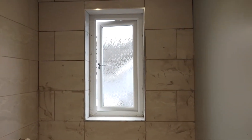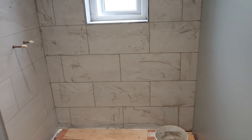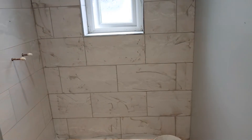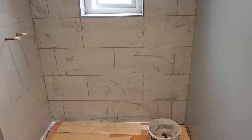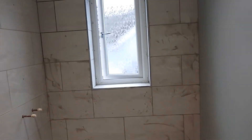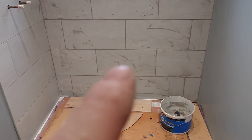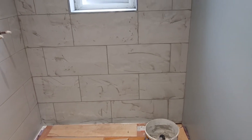You really want to get your walls as flat as possible. If you're getting a plasterer to set your walls out, get them to do it as flat so that there are no humps or bumps or shallow areas. Don't worry about it being smooth — you want it flat — because these big tiles have no movement, you can't flex them, so as flat as possible makes tiling a lot easier. I did have a bit of a hollow down here which I've had to pack out with adhesive. It doesn't make for easy working.